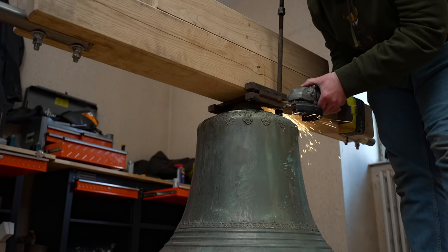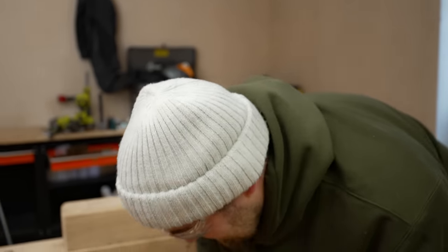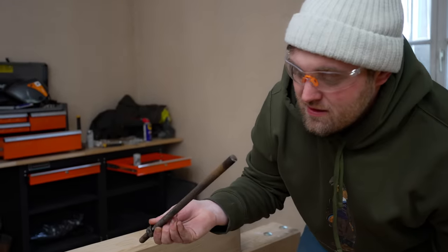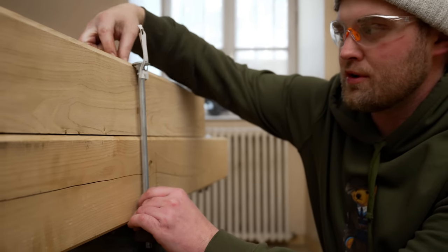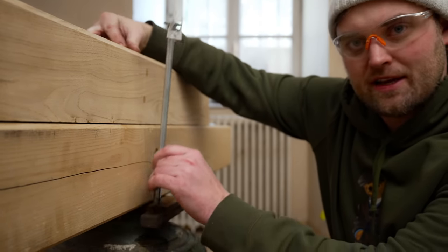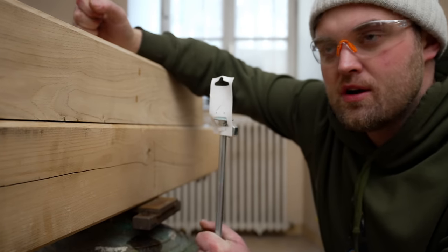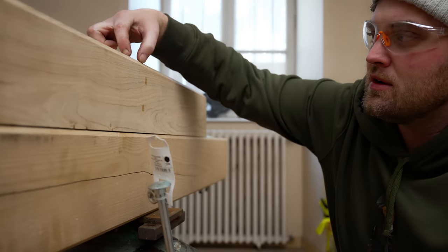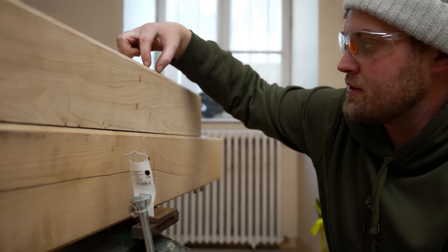That is really mild steel — it cuts so easily, which is a good thing to know because I'm putting in mild steel as well. Let's cut the other one off. That cut really easily, brilliant. The steel bar that I'm going to put across here, I'm going to slightly cut it in so that it can't move in the future — I'll go down probably one centimetre. So there'll be a bar across there and a steel bar across there as well.